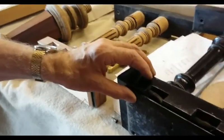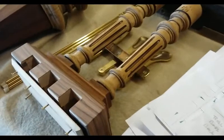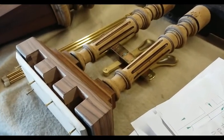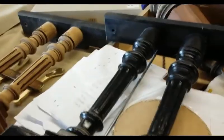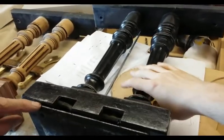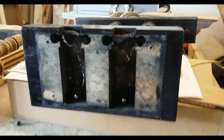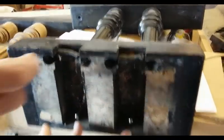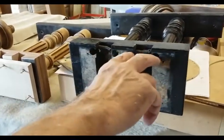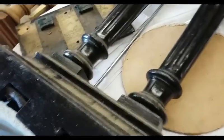Something else I haven't quite kept up to date with is the progression of the Lyre. That's the one that we've been converting to a three-pedal system. Just so that you've got an idea of how it looked before, this is one off of another Bechstein that's a two system. If we have a look under there, that is how the system looks originally with the two pedal sections, pivoted on dowels that went in there, so that they would pivot on these two dowels, just there and there.